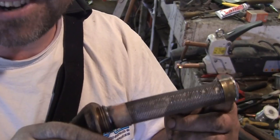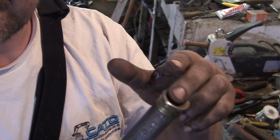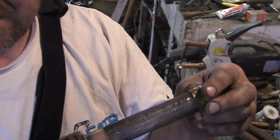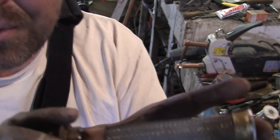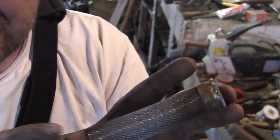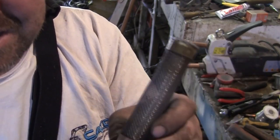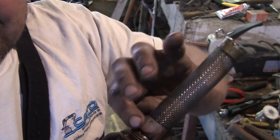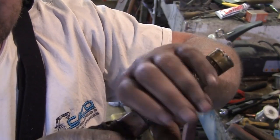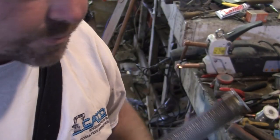Okay, so that's the finished article. We've got a solid plug at the end there. Well, not solid, but a sheet metal plug. The important thing is the mesh has turned out beautifully, isn't it? And I think it's much better affixed to the fitting than it would be if I'd just carried on using the tinned stainless steel mesh, because it really doesn't like taking solder.